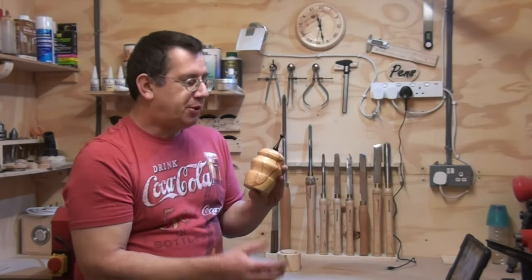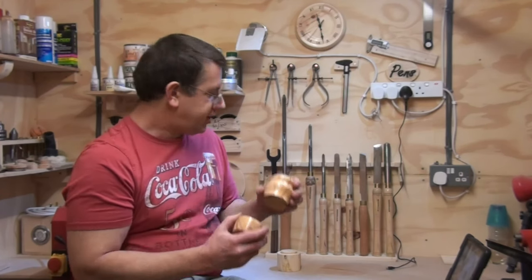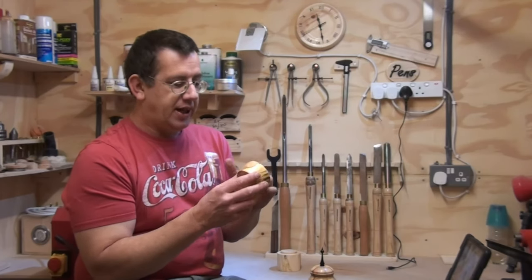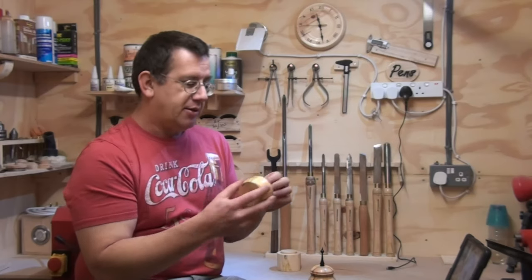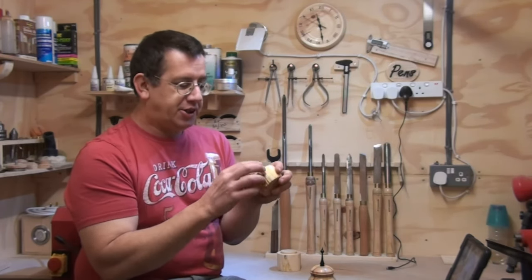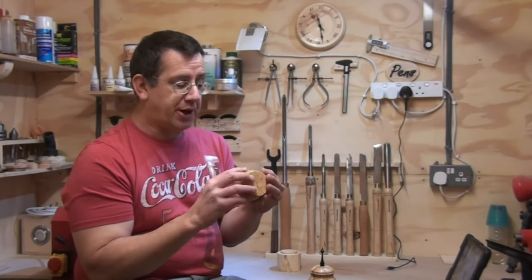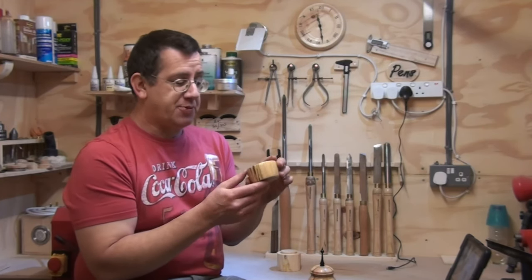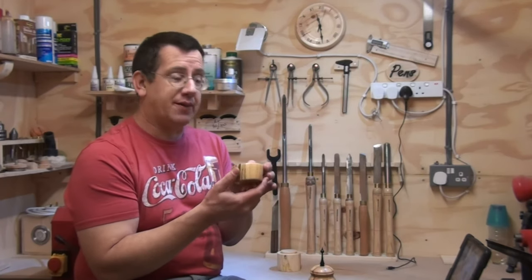But like I say, first problem came probably yesterday when I was making up my jam chuck to push these on, and I think it was actually this one, pushed it on and it just split the wood. So I basically just dropped some wood glue in there, didn't clamp it or anything because it's still got a lot of pressure on there. Left it overnight, came out this morning, redid the jam chuck, took off the bottom, no problems whatsoever.